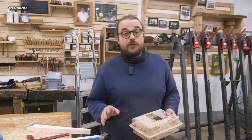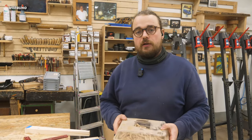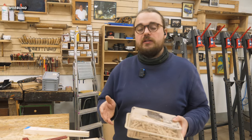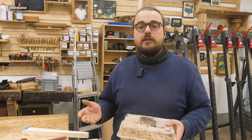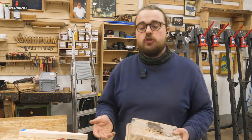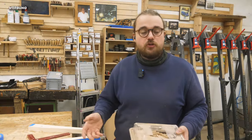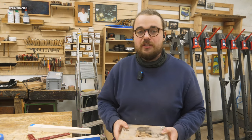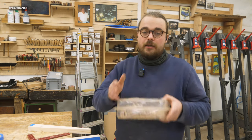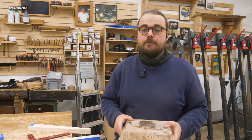So, I've just shown you the first type of connection. This is a type of connection that is particularly stable. The advantage of the mortise and tenon drilling machine is that you can choose the width freely. And the other great thing about it is that in combination with a table router you can also mill a full tenon on the endpiece and then the pocket or the part of the tenon. You can simply mill it with the mortise and tenon drilling machine. It's just great because you can build such wide connections, especially on doors or super easy peas.